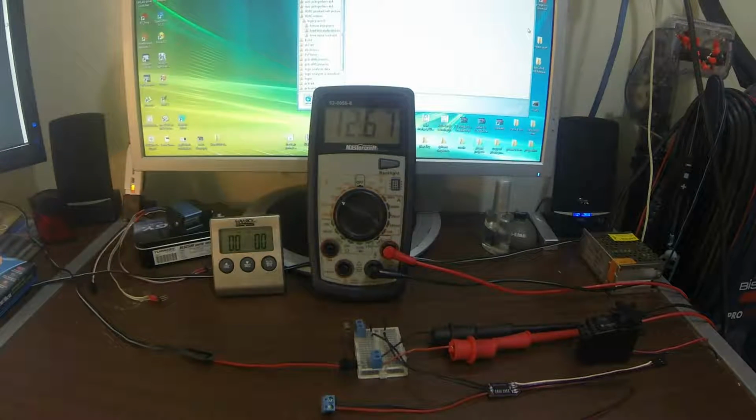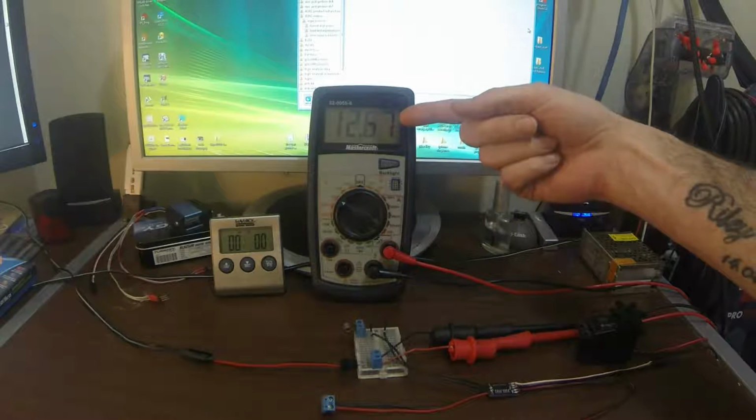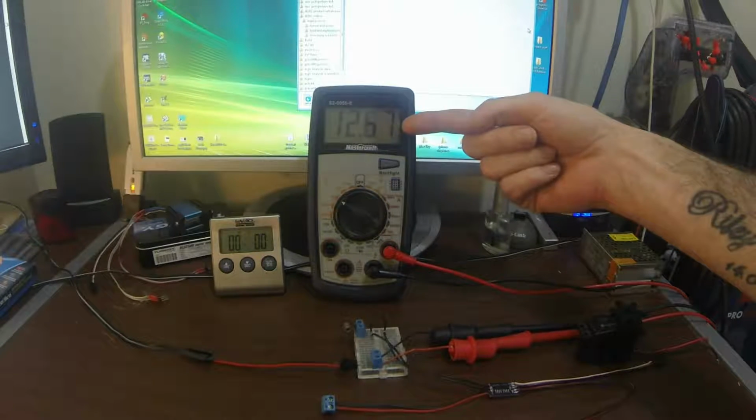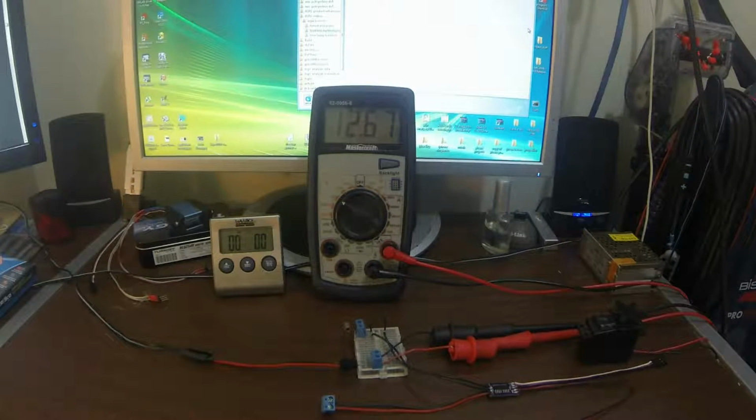So for the purpose of the test, we are running at the maximum recommended voltage that I have listed these devices at and that I tell people, which is full 3S cell, which most of us know is 12.6 volts once you fully charge them, and it's going to stick around that until you run it down. Personally, I didn't see a point of saying 11.1 and limiting to that, because we all know that's not the voltage you get when you fully charge your 3S cell.